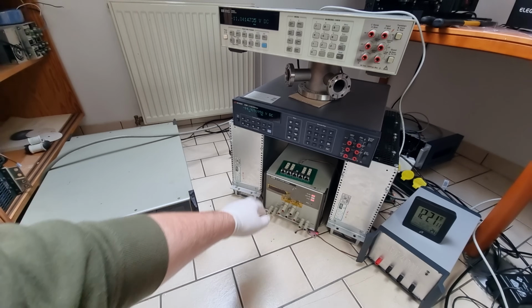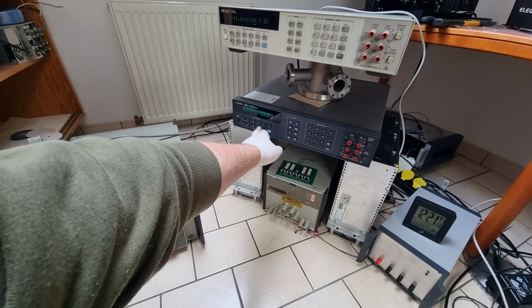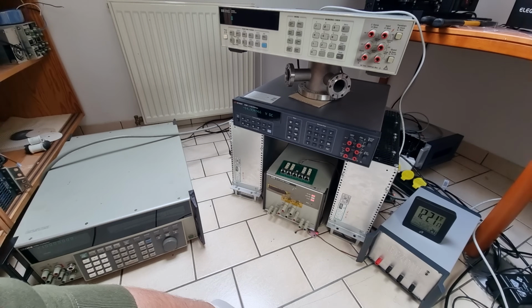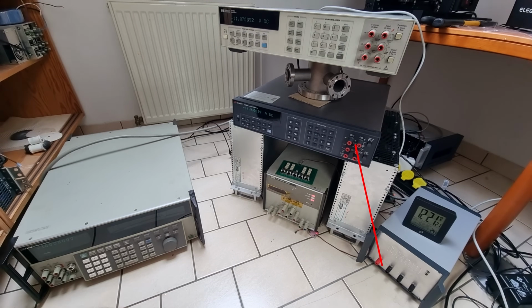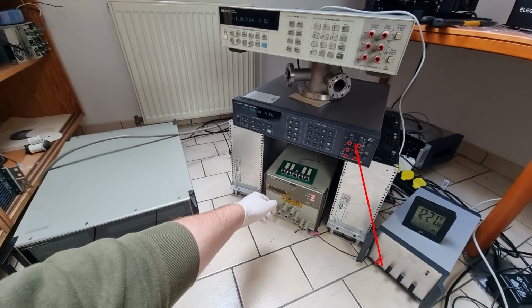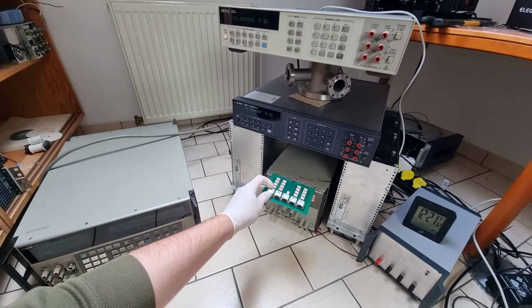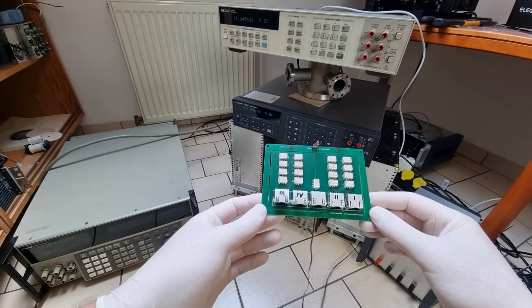Now I can't just connect everybody to one common bus. The 10-volt standards would average each other out, and multiple meters with periodic auto-zero features would interfere with each other. So what I need are true one-on-one connections. I guess I could get a disposable, unpaid intern to make and break these connections for a few days straight, but I'd be afraid that their body heat would interfere with these sensitive measurements.